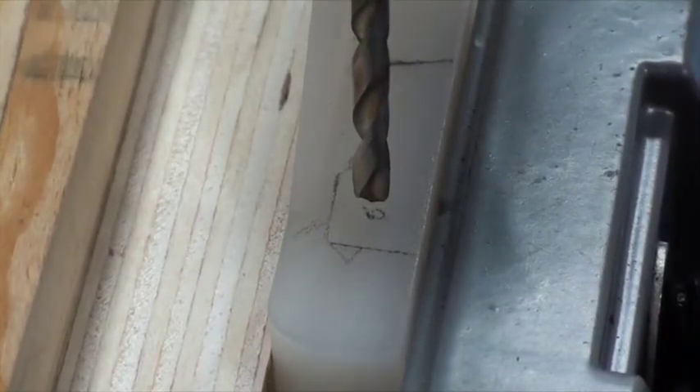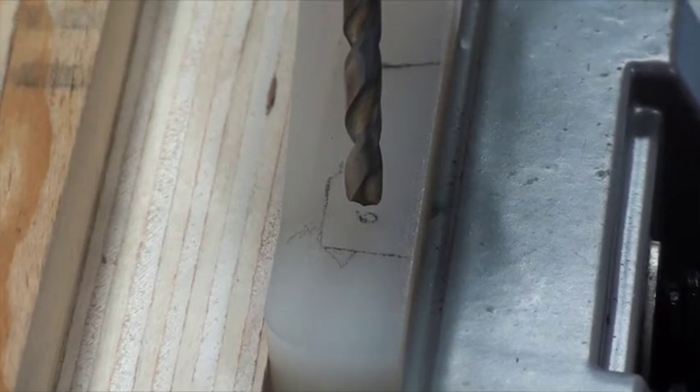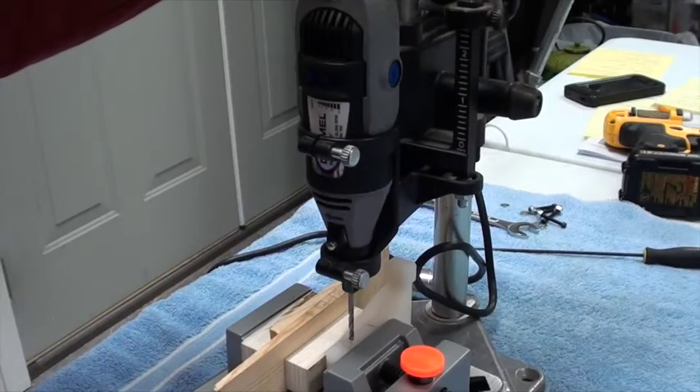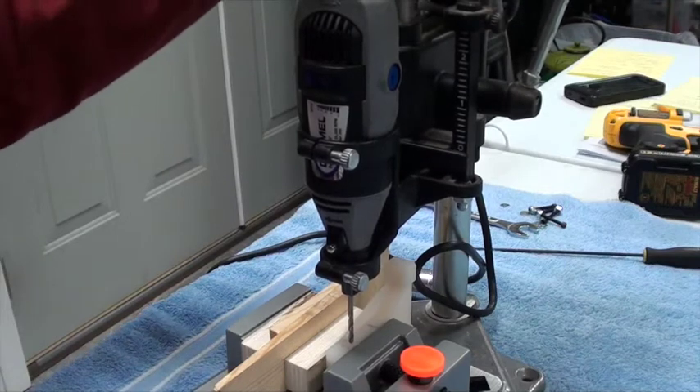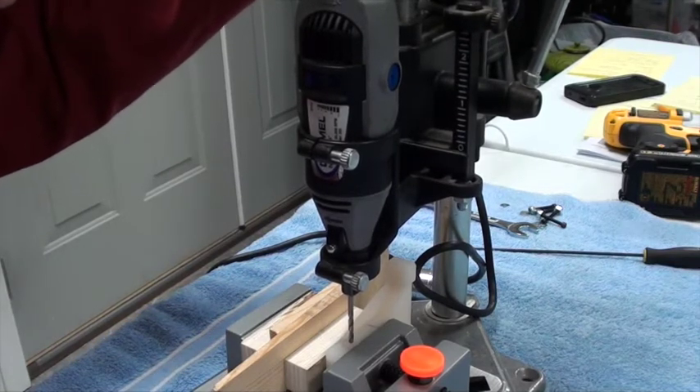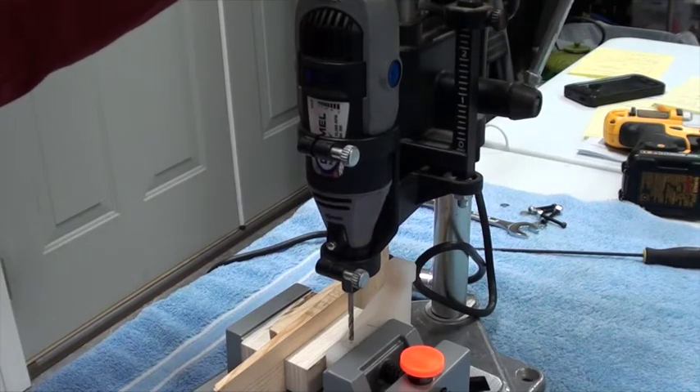I think I've got it where I want it. I'm going to stop the camera to make sure and then back the camera out so you can see how I drill it. I'm back. I've got it set the way I like. The way I can tell is I move the drill bit slightly in, and as long as the drill bit doesn't deflect front, back, left, or right, it's right in the center of that little pilot hole that we drilled. And that should hold it.